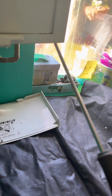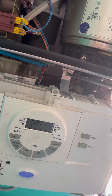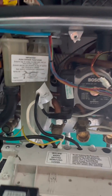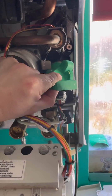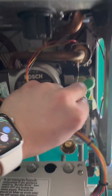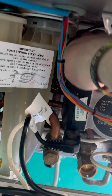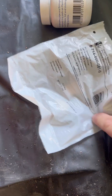Whipped the control panel down to have a look inside. First thing I'm going to check is the diverter valve — is it in the right place, and check the motor is okay. Yeah, all the way up — that's hot water, that's fine. Let's have a feel of the plate. The plate's red hot.